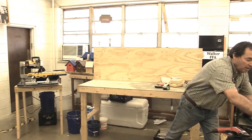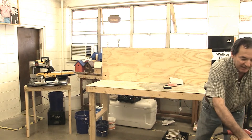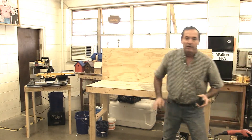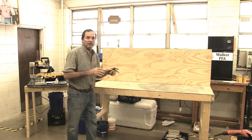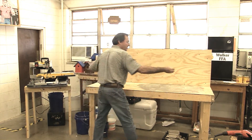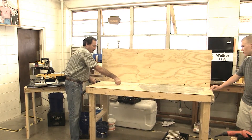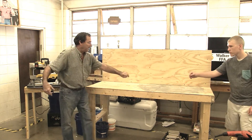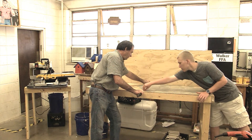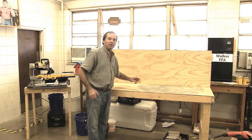We're going to talk about laying floor tile. I'm going to tell you how you're supposed to do it and how I do it. The way you're supposed to do it, you want to start in the center of your room — we're going to just pretend this is the floor. You measure to the middle of each end and pull that chalk line and pop it. It'll lay a blue line down there. Then you do it the other way too. Pop this line. Now you've got your center point of your room — that's where you'll start.